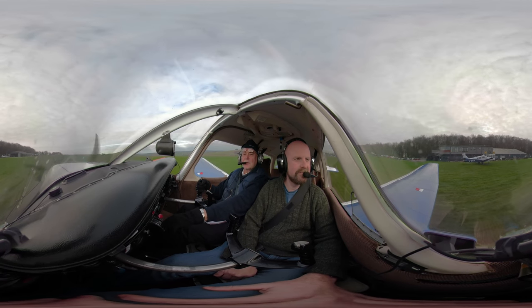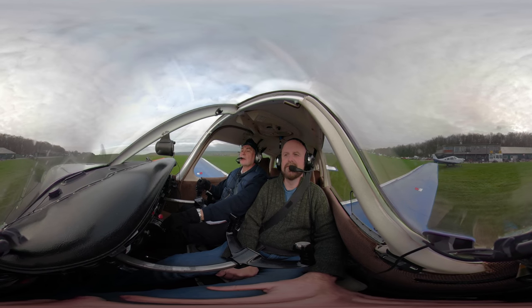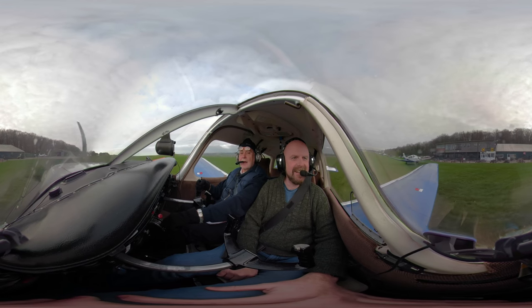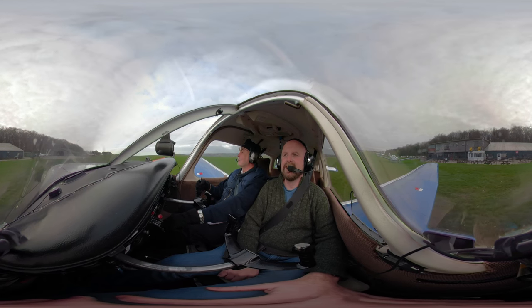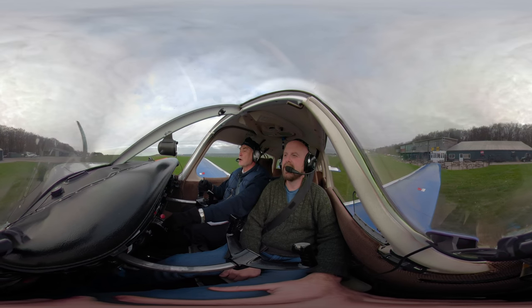So what we're trying to say is if you release your park brake with 1200 on, that's getting on for 50% of your max RPM. But you don't leave the car park on your motorbike with 6,000 RPM. So close the throttle, release the brakes, and then put the power on that you need to taxi with. Roger that. That's not too much. Oh yeah, we'll go this way.